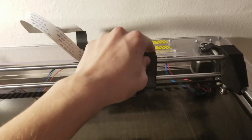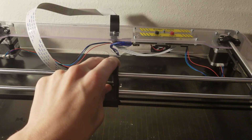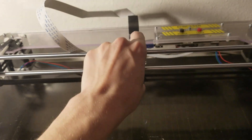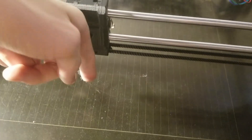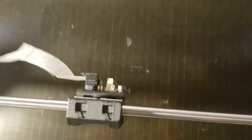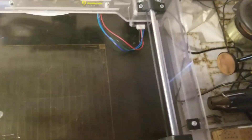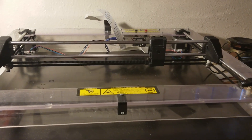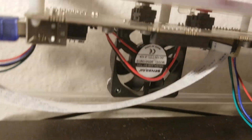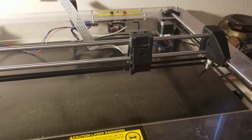See this? This is bad. If you're going to make a system like this, this is the manufacturer's design — don't just do a flat flex cable that you have to bend a billion times to keep it off the bed that has a laser on it. The end stops are on the head and not at the extremities like they often are. My way around that is I'm going to use Trinamic drivers on probably a RAMPS board — not the stock board here — and do the sensorless homing thing.